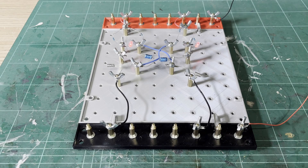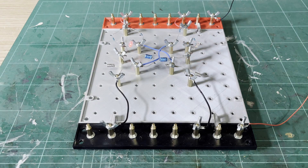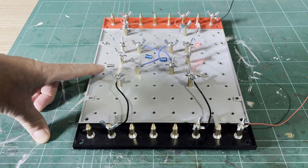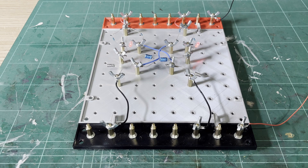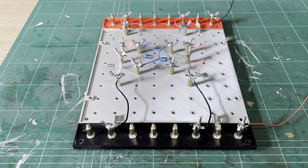I gave the system a test and it went together very well. Since I don't have the high-tension supply yet, I built a transistor-based astable circuit using Romanian germanium PNP transistors from about 1983 — vintage components. What I like about old components is the very long, thick leads which suit this construction style well. The wing nuts are very convenient to use, and I could swap them for regular nuts if I wanted to build something more permanent.